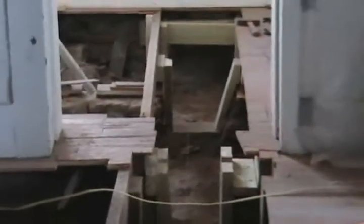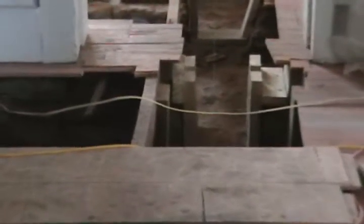That ditch took a good little bit of work to get all done, but I'm very confident. I wanted to make sure that when I terminated these beams, there was plenty of support so that there wouldn't be any movement, spreading, or falling apart of the adobe blocks. I'm pretty confident that got done.